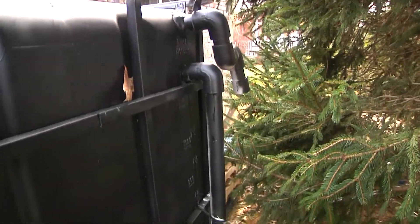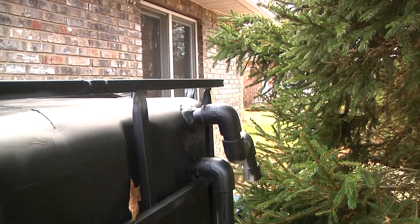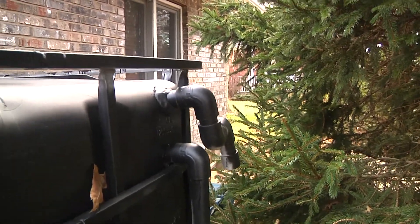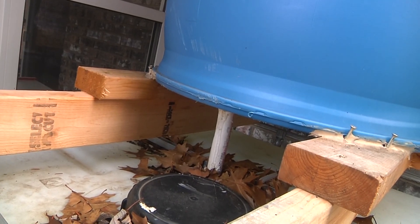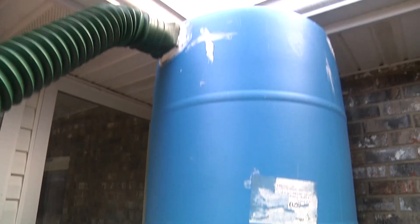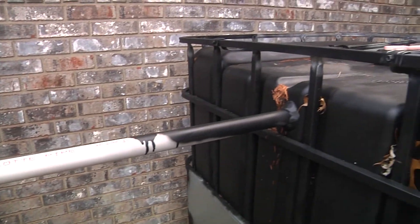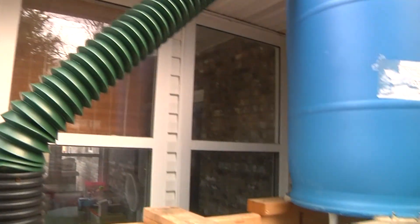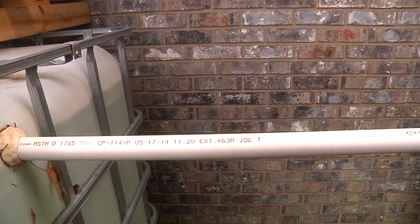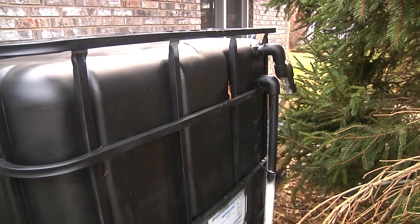Over here I've got an overflow that runs off, and because I always like to overdo things, I've got a secondary overflow just in case we've got a real gully washer with a lot of rain coming down. The piping coming out of the filter is three-quarter inch, and there's a reason for that. With the overflow in case things really get going, I only want enough water coming through for the three-quarter inch, because over here is one inch. I don't want the system to get overwhelmed — this one inch will never have more flow than the three-quarter inch. I've got my extra backups over there just in case.